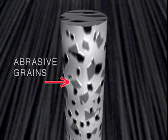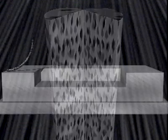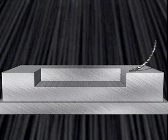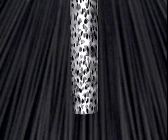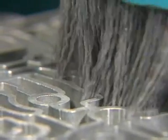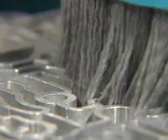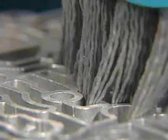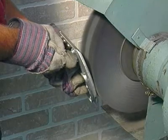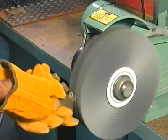Here's how. Each heat-stabilized nylon filament has silicon carbide or aluminum oxide abrasive grains distributed throughout. While conforming to the irregular surfaces of a workpiece, the filament's sides do the cutting. Then, as the nylon filaments wear, new, sharp cutting grains are constantly being exposed, thus providing a compliant tool which is able to follow the contours of even the most complex part configurations, resulting in aggressive finishing and shorter cycle times. Your deburring and finishing costs are reduced without sacrificing the geometric shapes of even softer non-ferrous metal parts.